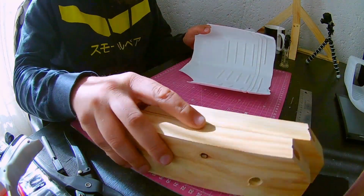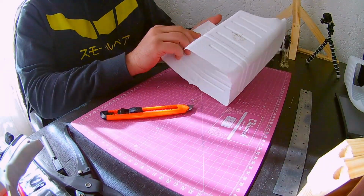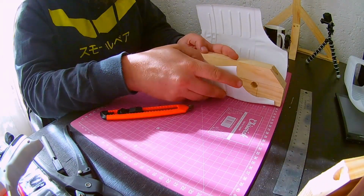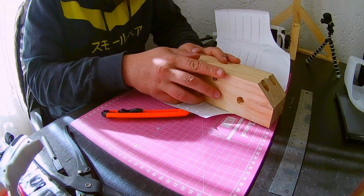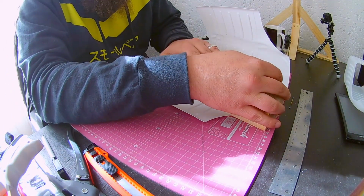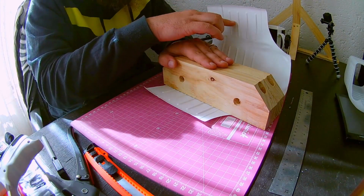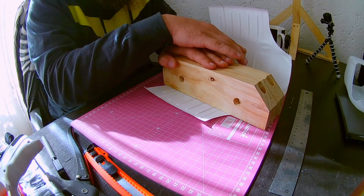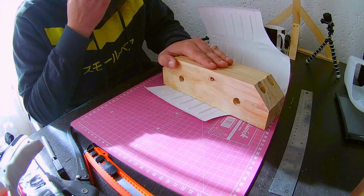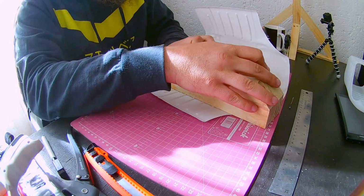There you go. Much better. Look at that. Okay, other side. Do the same thing. Okay, when doing straightening like this, I try to warm it up for quite long, because I'll show you now, it's already starting to go back to its original shape there because of the heat that I've applied elsewhere. It does have a tendency to want to do that, this plastic.